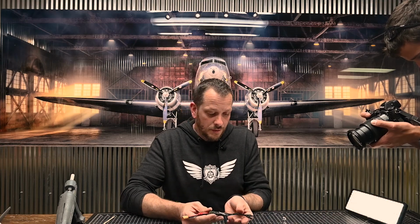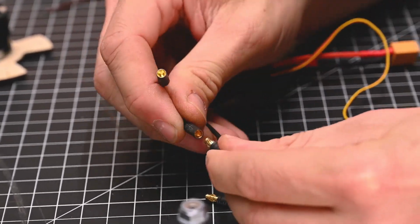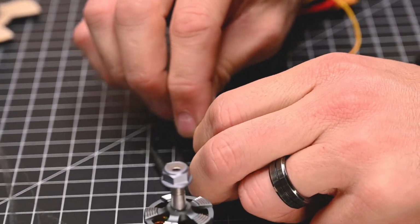Along with our motor power packs, we also have an ESC. An ESC is going to control the speed of the motor and then tie directly to our receiver. Now with the ESC, depending on how we hook it up, it will affect the direction of the motor. The first thing we want to do is connect the 3 bullet connectors from our motor in any order that you see fit, like you see here.